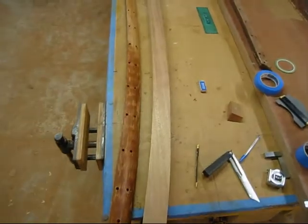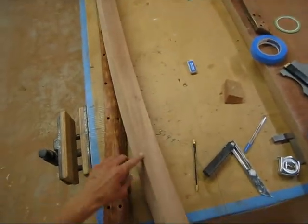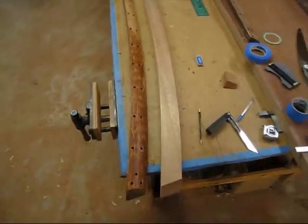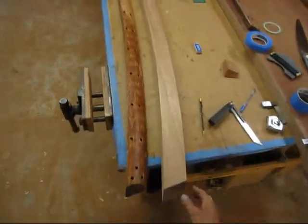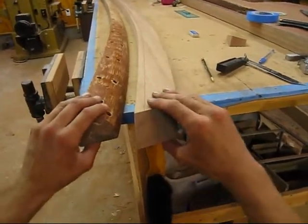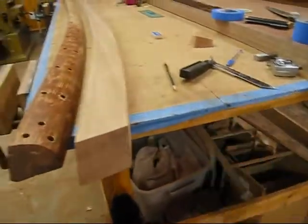I have the port covering board cut to width. I made a mark underneath, took it to the bandsaw, then ran it on a disc sander so it's just about a 32nd over where that wood rub rail is going to be. The width is there. Now I'm going to cut the two angles to take away some of the material to help me, once this is on, to fair to get this profile here. I'm going to do it in two cuts.